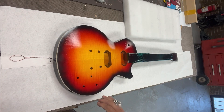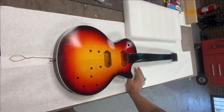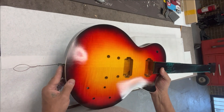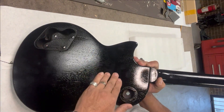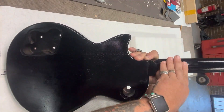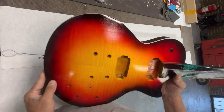I do notice that I didn't use grain filler like the instructions recommended — the stuff StewMac provided with the build kit. I'd never used it before, but I'm really seeing why they recommend it now. You can really see the grain in the back of this guitar. It's not deep, it's super super smooth, but I can definitely feel it as I run my fingers over it. The neck is really good though — super smooth, no ripples or anything from the clear coat.